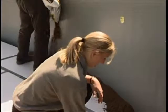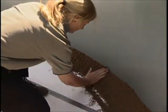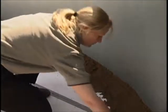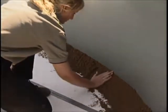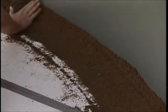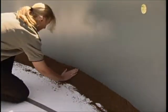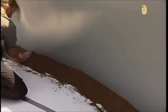Whether you use sand or styrofoam, you must construct a cove of brick sand around the inside bottom of the pool wall. This is an important part of the pool structure because it redistributes the pressure of the water on the bottom edge of the pool wall. The cove should be about 8 inches or 20 centimeters wide and 6 inches or 15 centimeters high. Where the buttress uprights make the pool wall scallop slightly, this cove will be a little narrower and a little shorter to maintain the horizontal line of the cove. Pack the brick sand firmly into shape and smooth it out evenly.